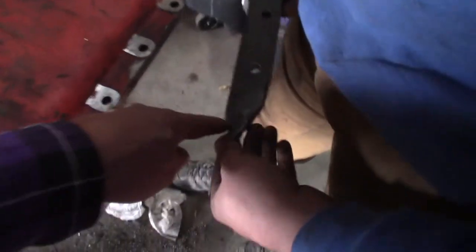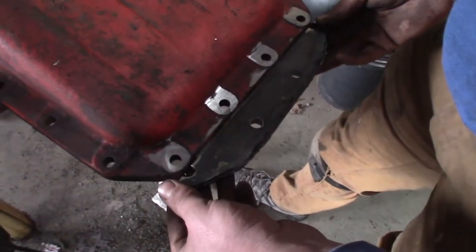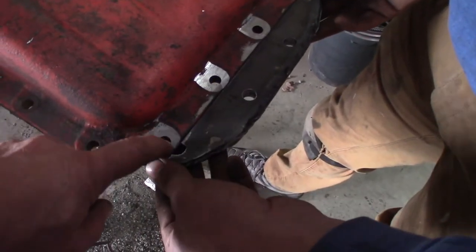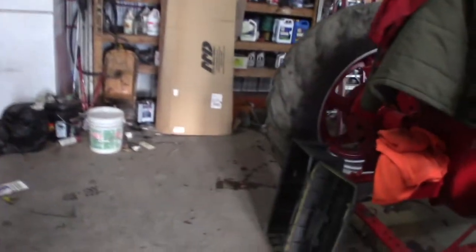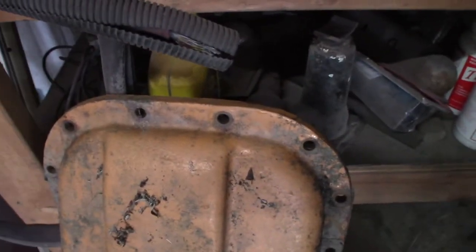Right, because this matches the tractor, but the rail. Yeah, this hole here. So he's got to finish looping that out so we can get a bolt in there. What Case did was they went from this squared off pan because of the front timing cover to that round. And when they rounded it, they made it longer, so yep, we're just making an extension.